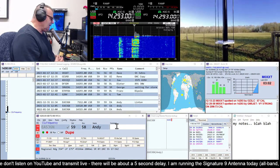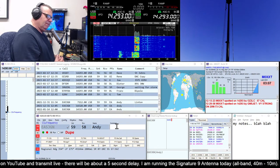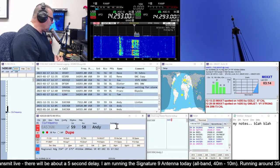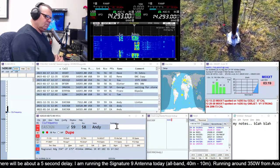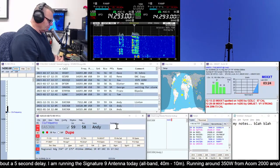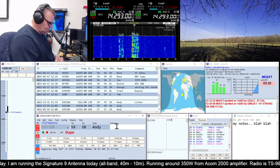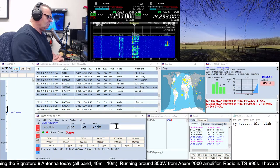M0XXT, EA5JGN. Ah, right, OK. So how long ago did the radials get ploughed up then, over? Oh, I think it would have been probably this time last year, and no one bothered telling me. Yeah, OK, fine. And how much had the tuning changed? Well, interestingly, the VSWR started off at 1.44 to 1, with the correct resonance on 1521, and after adding the new radials, it dropped to 1.3 to 1, which I know is not much, but it does show that it was necessary.